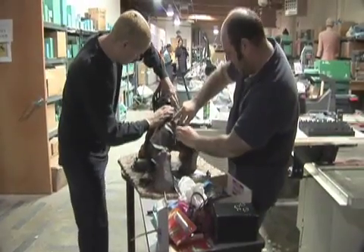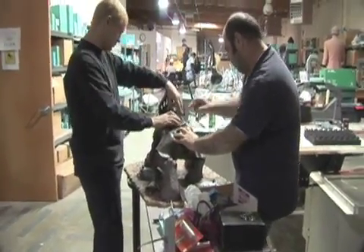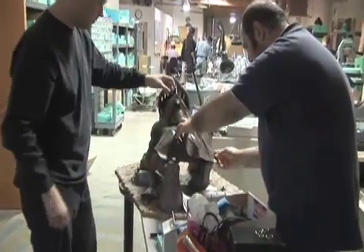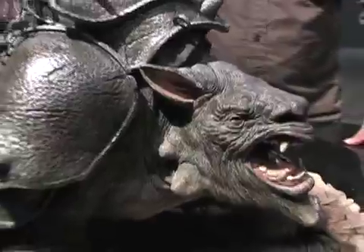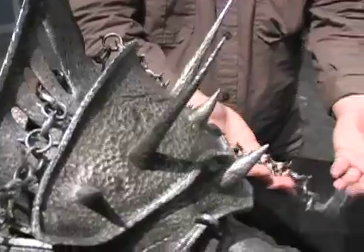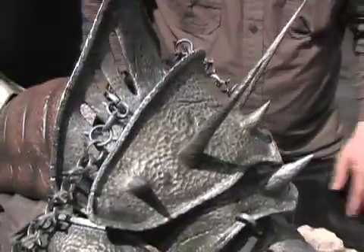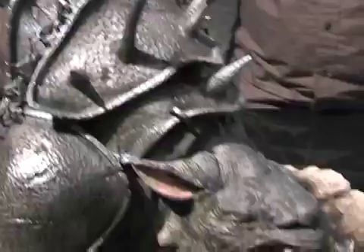Those were then reassembled and the transitions retooled. We fixed up any areas where we lost detail, and then took another mold of the entire character in silicone. Then we cast that again, but this time in a two-part resin — a hard plastic. So the Chromath body is a solid hunk of resin, whereas the armor is plastic directly off the rapid prototyping machine.